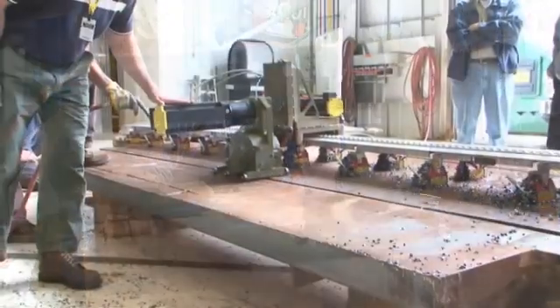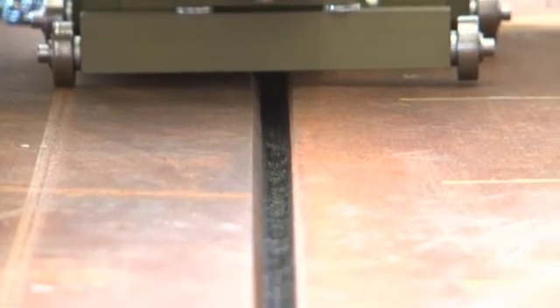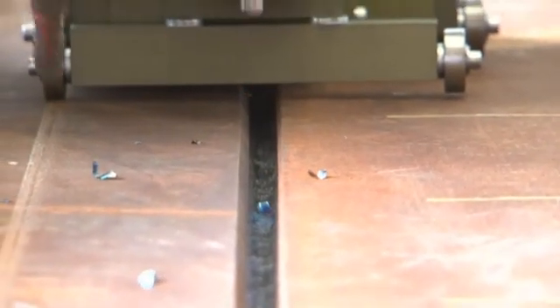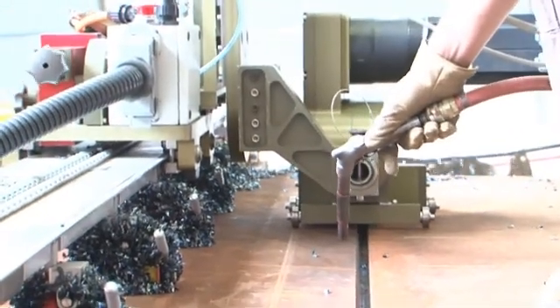The carriage and cutter move quickly and smoothly along the weld joint at a depth of cut of 1 quarter inch per pass, with a noise level below 90 decibels. The root of the back gouge is 1.5 inch diameter and blends smoothly into the side walls of the 45 degree double V butt joint.